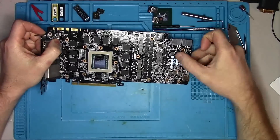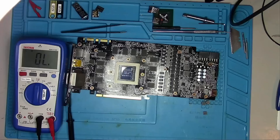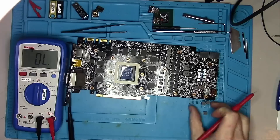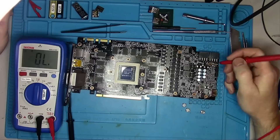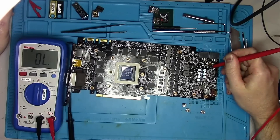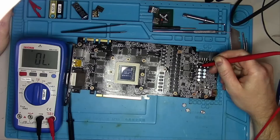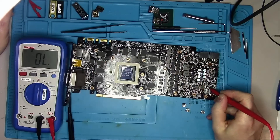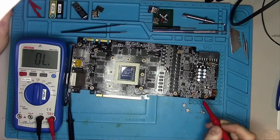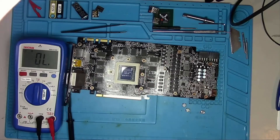Normally you would want to start with a visual inspection, but I'm too lazy, so I'll take a shortcut by using my thermal camera. First I have to prepare the board by removing these coils in order to help localize the problem area. In order to have any sense of direction in which to dig, when coils are removed we check each pad separately. The pad that shows less resistance tells us which way we need to look, and it looks like they're pointing us to the left. The pad at the bottom also indicates the problem is on the left.